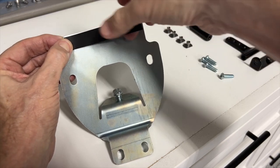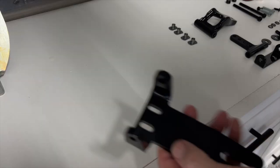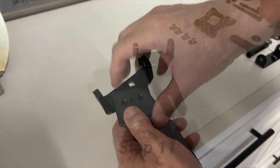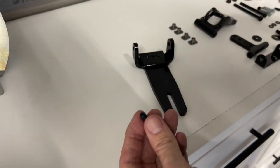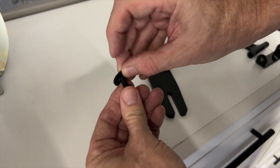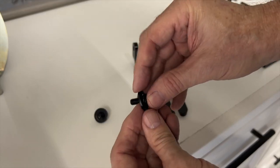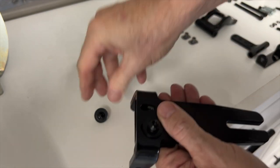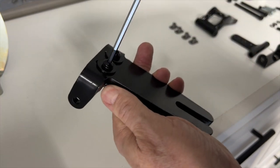I'm jumping around a little bit and not doing things in the same order as the instructions show. We're going to mount this adjustment plate to the riser. You can always refer to figure 10 on the instruction sheet for more information, but we're going to start by placing a lock washer onto one of these M6 by 18mm long screws, and then put a flat washer after the lock washer. Now we can install those screws through the riser into the threads on the adjustment plate as shown. Use an Allen wrench to tighten these down firmly.